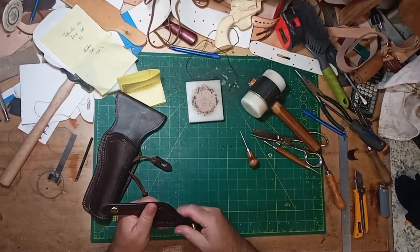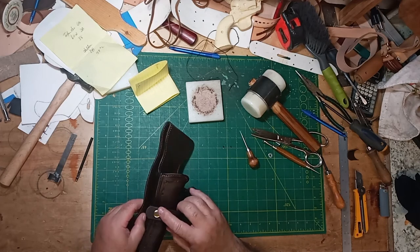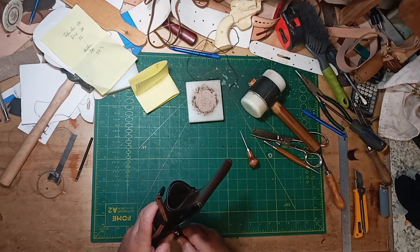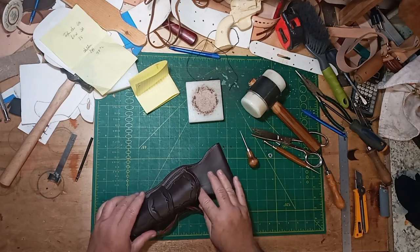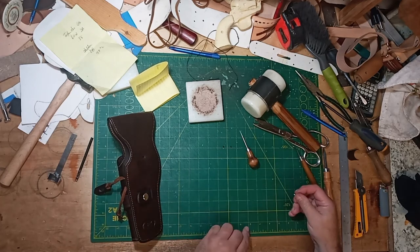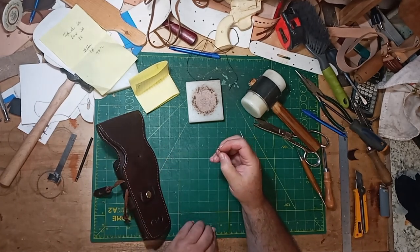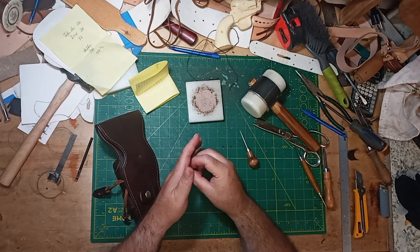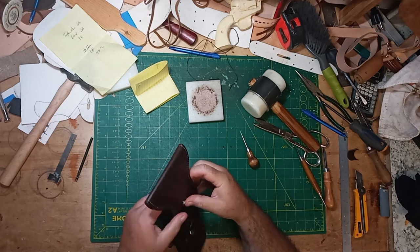Then I take this strap, push the ends through, snap it in place. Now if you opted to do without the block, that would be what you would have. Now with the block, if you went with the T-nut and the block, you have here an 8-32 flat, or number 8 flat washer, and an 8-32 by half pan head cap screw or machine screw, I guess this one is, but it doesn't really matter what you have, but that works.